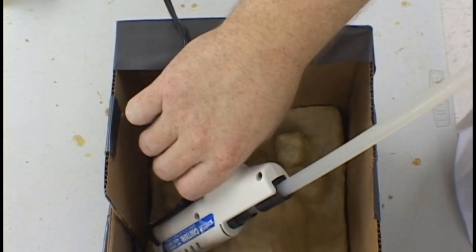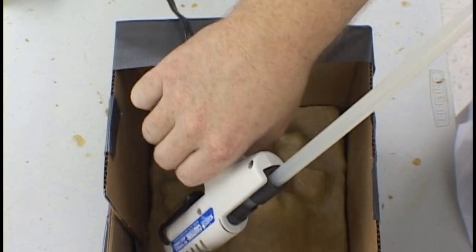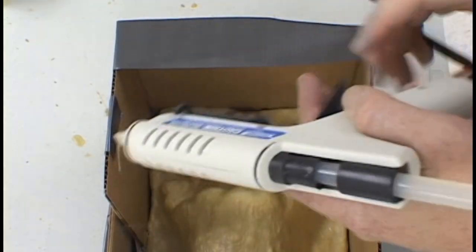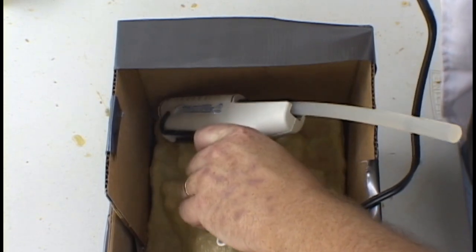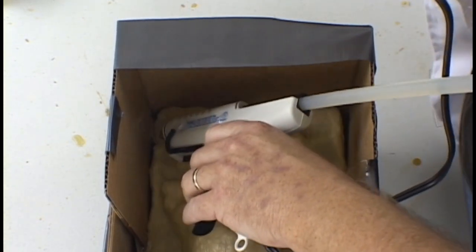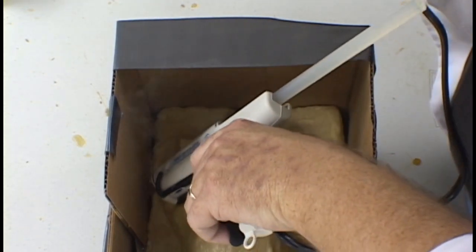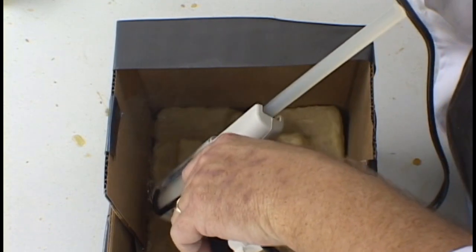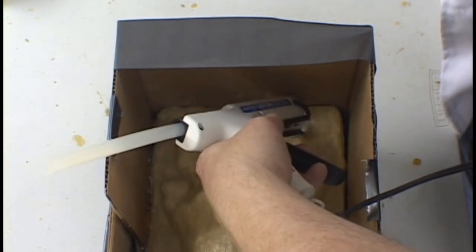After our basic box is created, it is now time to seal the two separate halves of the mold shell. Using a glue gun to start off with, apply glue along the seam between the edge of the parting plane and the cardboard box. The glue will stick to both the latex and the cardboard box and give you a starting point before you apply clay to give you a nice smooth parting plane. Be very generous with your glue application.